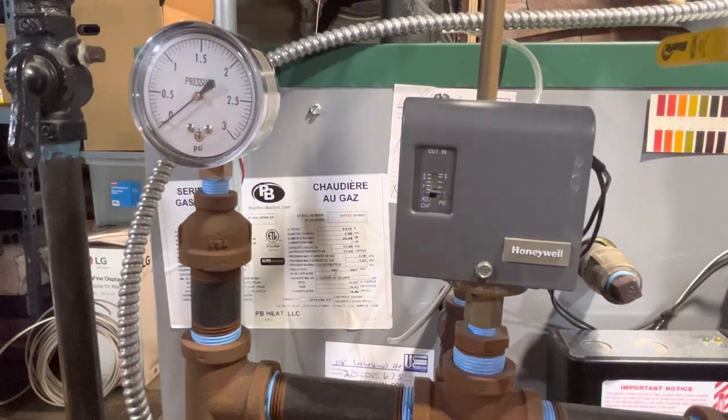Oh, the Pressuretrol is such a disappointment. I've got it set on 2. There's a 1 differential on the dial inside, so it should shut off at 3. And here it is shutting off at around 5 or more. And it's supposed to cut back in at 2. I assume it's going to be somewhere around 3. But everything's perfectly quiet. I can't hear a single sound.